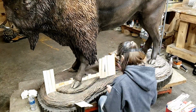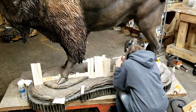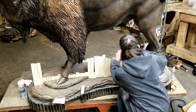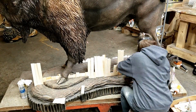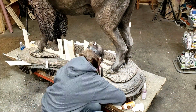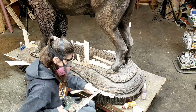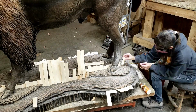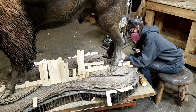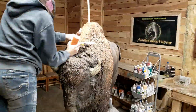Say you don't make the angle on the wedge just right. If it's a little too abrupt, or if it's too long, you can run into problems. If it's too long and you have too much angle, you're going to have a gap on maybe each side. But if you don't have enough angle, then it's going in there with blunt force, and it has a tendency to split it. Like if you had a mauling axe and just hit a piece of wood, it's going to want to crack the wood up.